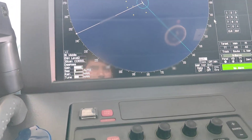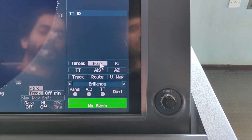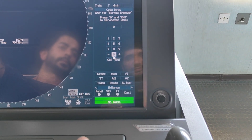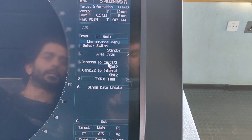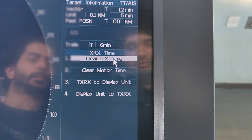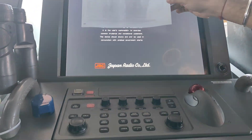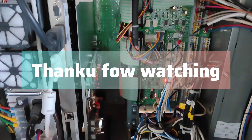Once all these steps are done, you can reset the running hours for the magnetron. On the display, go to the main button, click left, press zero, then enter. You will see multiple options — go to maintenance settings, then transmission time. You have the option to clear transmission time and clear motor time. Clear whichever option you need, and your running hours will become zero. That is how you start your radar after a magnetron change. See you in the next video — bye bye, take care.